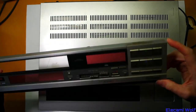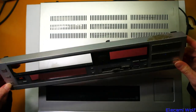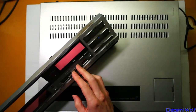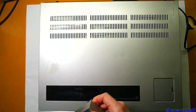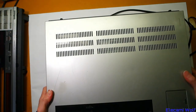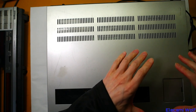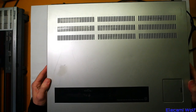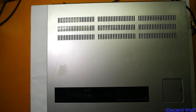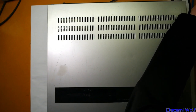In the previous video, we were looking at this VCR NV870, trying to debug why it doesn't power up properly. We traced the problem back to an oscillator on one of the ICs on the timer board not running. I tried forcing a clock signal into it and that didn't get it to run. I've dug out another NV870 VCR that supposedly works — that's what my notes say — so we'll test it out.